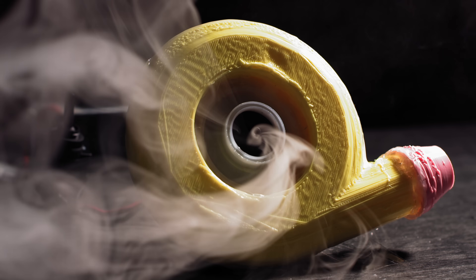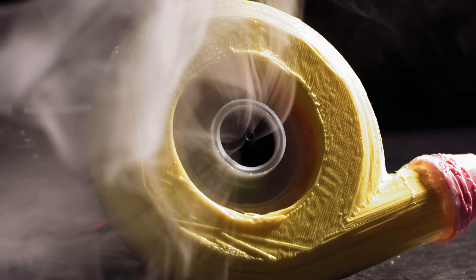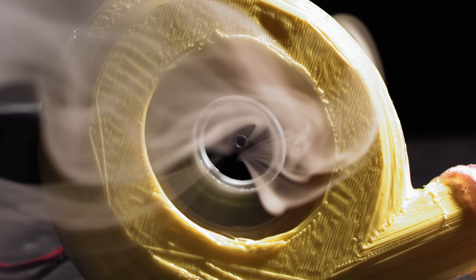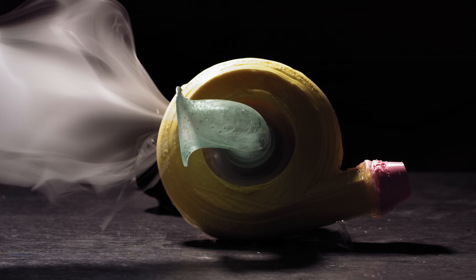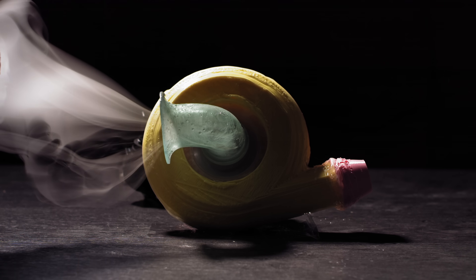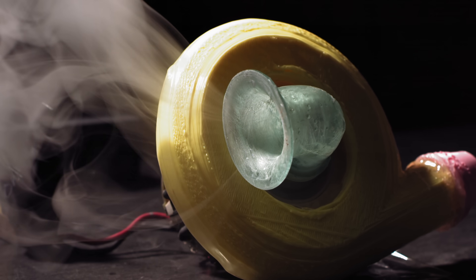The Dyson motor's intake has these sharp ridges. This footage was shot at 420 frames per second on the Freefly Systems Wave camera. I was concerned that the sharp edges of the intake would generate turbulence that would reduce thrust, so I designed a flared bell-mouth intake — a tuba-looking thing — to help smooth out the flow. One interesting thing is that the impeller completely removes the fog from the air, probably because the fog particles go through what is essentially a centrifuge and get flung to the walls and turned back into liquid — which would explain why there was a puddle on the table.